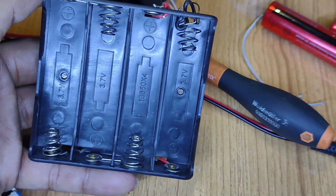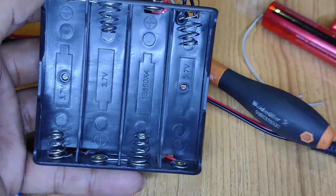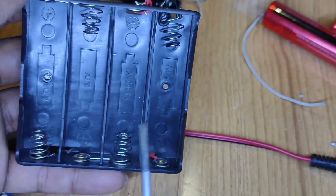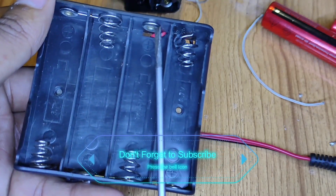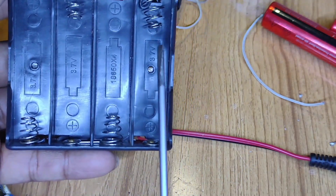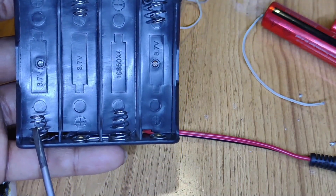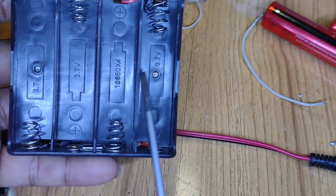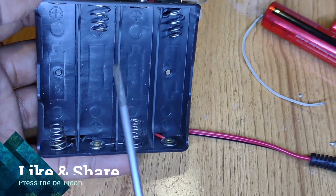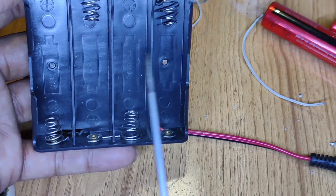This is a 4S battery cell holder but I'm connecting the 3S BMS connection with these batteries. For some modification I just want to clarify something for this connection. I want to parallel these two batteries, and after that this can be in series — so these two connections I want to parallel with each other, making the 3S battery cell where these two cells count as one cell, and this is one cell and this is another cell — total 3 cells.